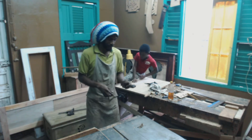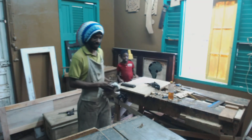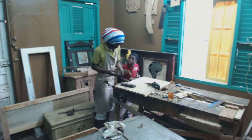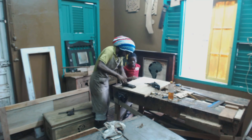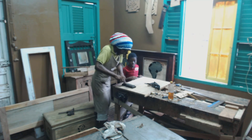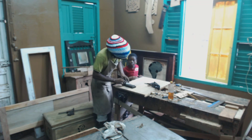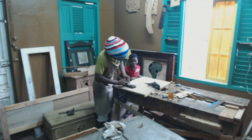And one of the things that I tell people about sharpening tools is you want to get the feel in your hands. You see the gadgets? These are the gadgets and things that help you keep the angle. What happens when you don't have that gadget? When we were learning, everybody learned to sharpen their plane like this. You watch the angle, and you put your fingers, press it like that, and you start in a motion. So you want to get the feel in your own hand.